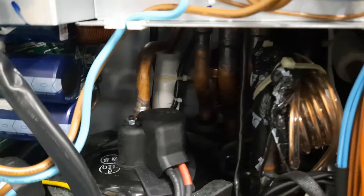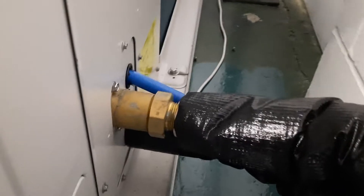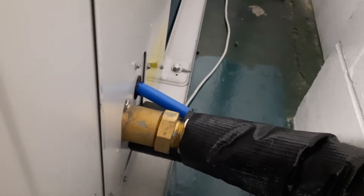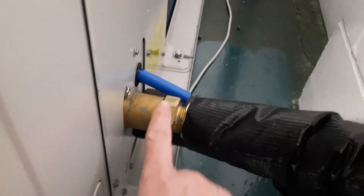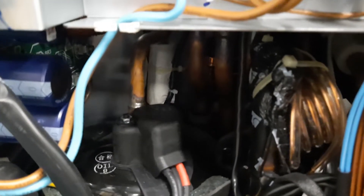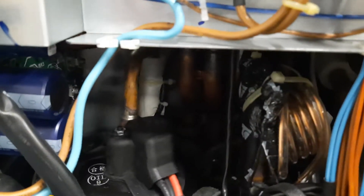Really, really good tip for you here, especially if you're not a fridge engineer. If you go when the unit is running and have a look around the back, touch the outlet pipework where the water pipework is coming out of the unit, and measure the water temperature. Let's say this is at 50 degrees C — you can read this from the controller — but if the water is at 50 degrees C, this pipe coming out of the compressor, as a rule, should never be more than 35 degrees warmer than the water. So if the water's 50, I'm not expecting to see anything above about 85 degrees here.